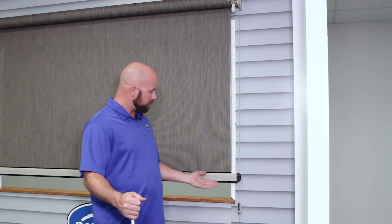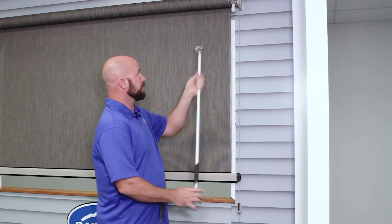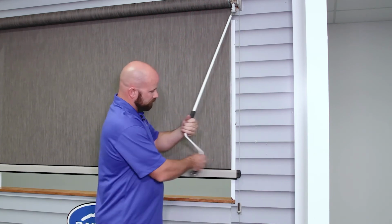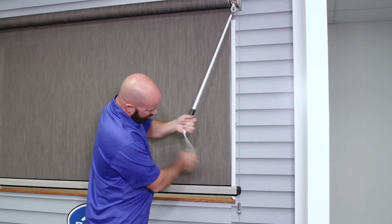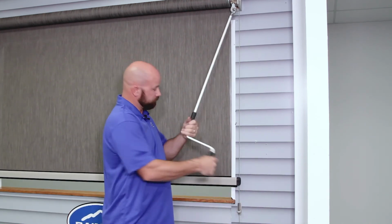All right, now you've got your cable installed on your Express screen. You can actually come back and trim this extra tail off. I usually leave about a 1/4 inch sticking below, just so in case you have to come back and service it at all, you get a hold of it with a pair of pliers. Just trim with a pair of cutters of some sort, cable cutters or just side cutters, doesn't matter. Feels good. You can test it out by cranking it. Run her down to there. Make sure it doesn't hit here. And then run it up and you're good to go.